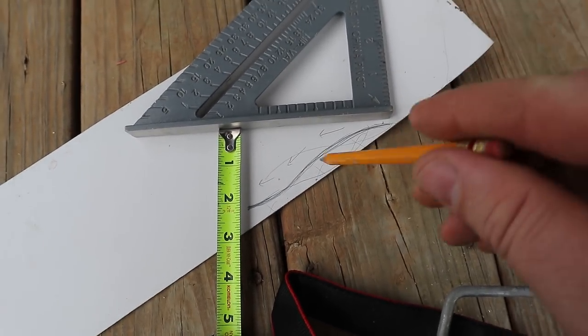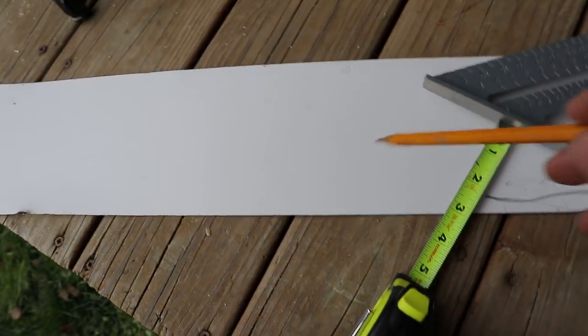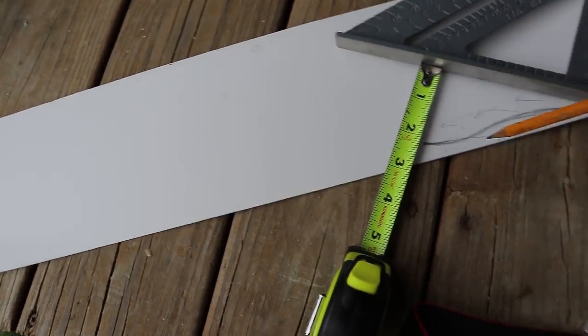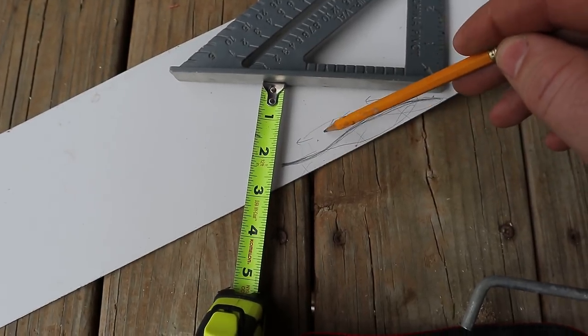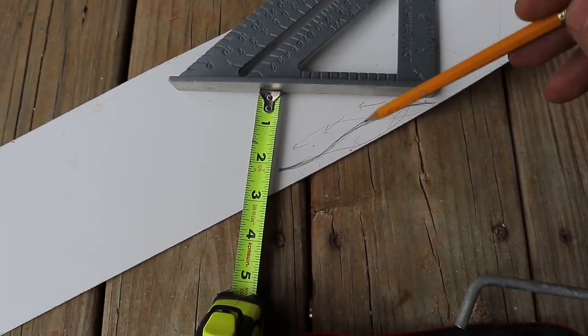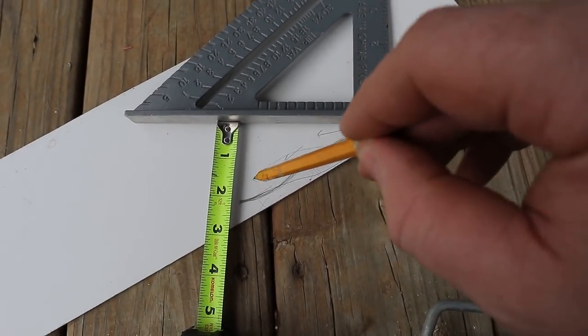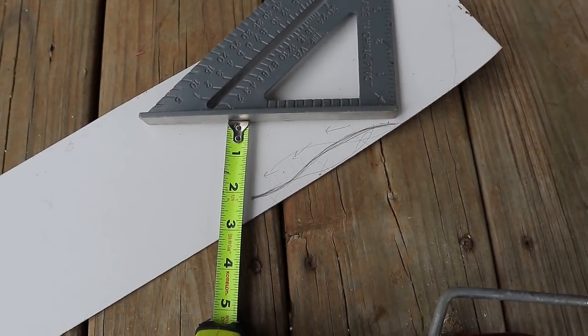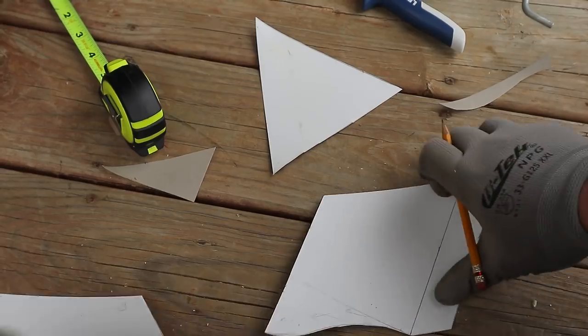There's 2 angled blocks I have on there. And then I'm going to take some more of this sheet and cut tabs in the bottom and then fold the tabs over. So I'll have a tab here and a tab here and a tab here, and those will be riveted on from the bottom. And then silicone everything. So that should give me a nice smooth chute to deal with.